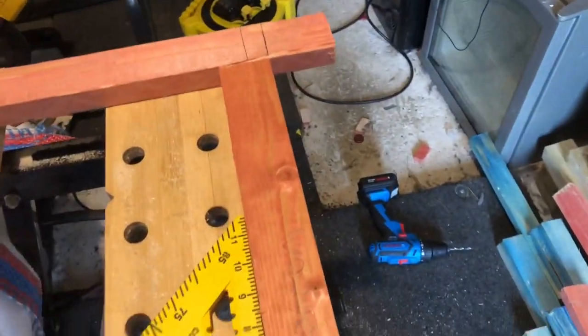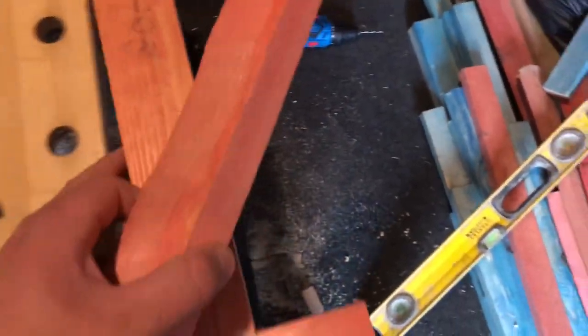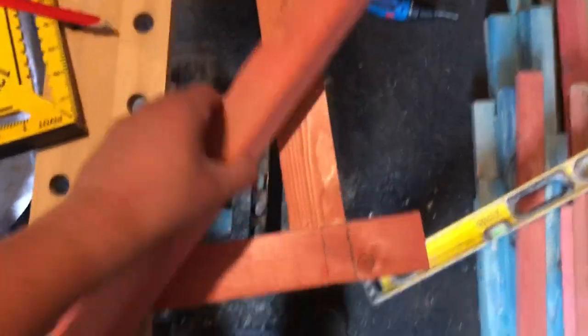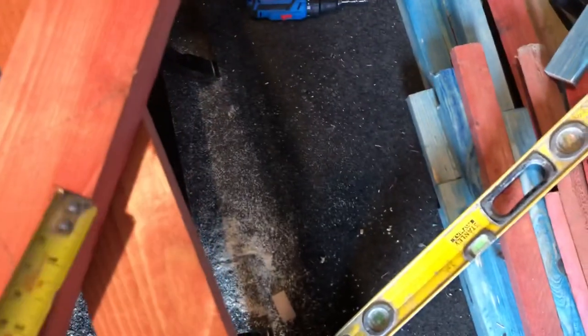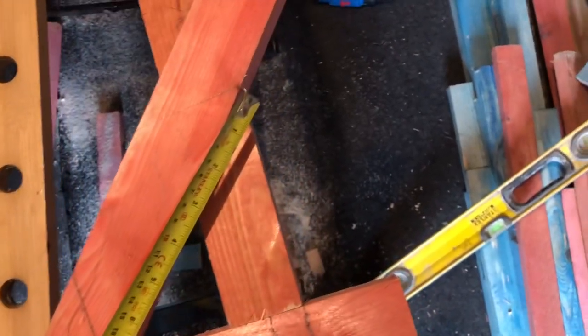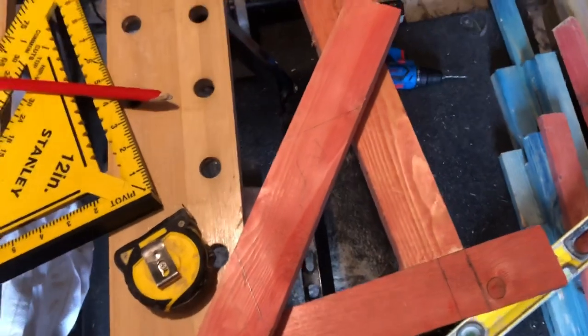Now that's together we need to put the support pieces in - these should theoretically be at 45 degrees. Luckily I've got a cross cut saw that does 45 degree cuts, but if you didn't have one you'd just mark a bit of roofer's lath diagonally like that and cut underneath that piece of timber and there's your 45 degree cut. Roughly we want these cross pieces around 200 millimetres for the supporting pieces. I'm going to go cut some 45 degree support pieces now and you'll see me do it on the cross cut saw.